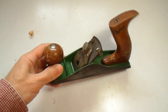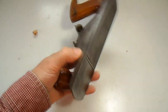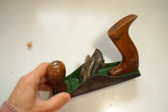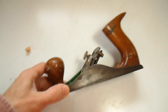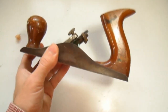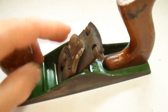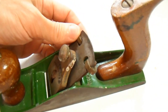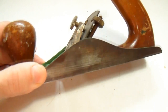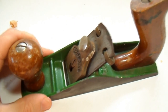Another favorite hand plane is this one. What's unique about this one is it's very light, and usually you want your hand plane to be nice and heavy. But a light plane is very handy if you have to take it somewhere in your luggage — I've actually had this plane with me visiting my sister a few times because I can just put it in my suitcase and it doesn't add too much weight. An interesting thing about this plane is the way the blade is adjusted: there are two screws to adjust the left and right side individually, instead of having a long lever and adjustment knob. You have to adjust one side at a time, like you would on a spokeshave, but it works okay and it's a nice little plane.